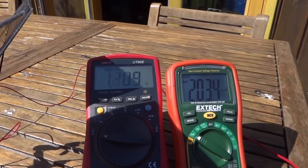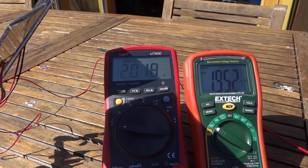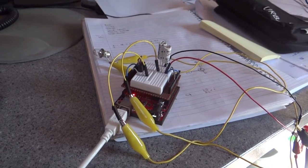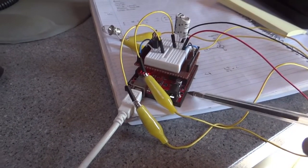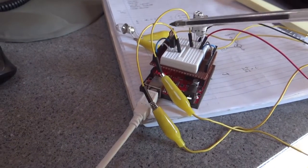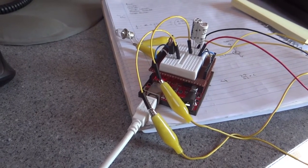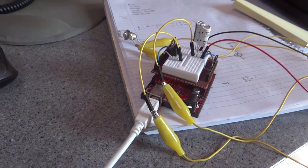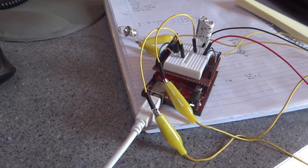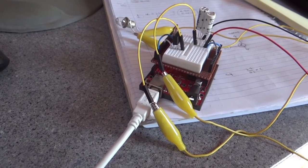This is the second instalment — it's built up on a breadboard. Under here we have an ordinary Arduino, the two supercapacitors from before, and a MOSFET. The Arduino is running a very simple program: when the voltage in the capacitors rises above something just below 5 volts — I've forgotten exactly what it is, we'll look at the code in a second — it turns on the light and keeps it on until the voltage in the capacitors drops to something just below about 50 millivolts.